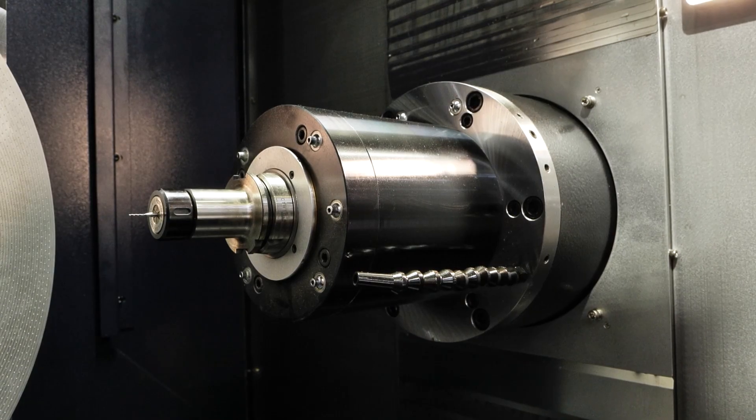It's a new development in our range, because our current existing line of horizontal machines is not really suitable for what this machine can do. They are too heavy, they are too strong, and for this they are a little bit too slow — though of course they can machine titanium and Inconel without any hesitation. So this machine is a completely different approach. We are using linear roller guideways from a very reputable brand. We have designed the machine new, and particularly the spindle adapted to the needs of Semicon — fast, reliable, and temperature controlled.